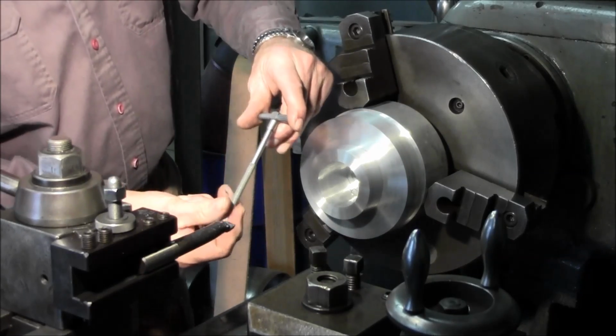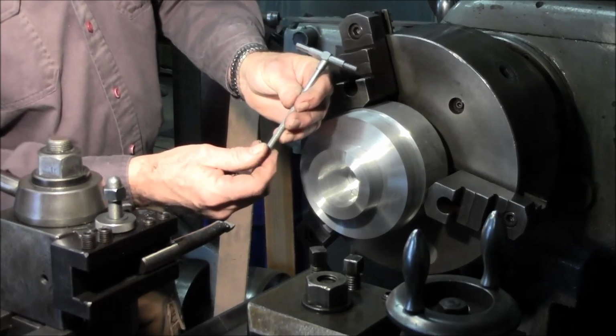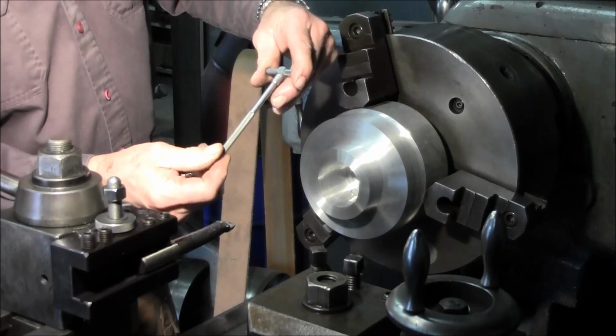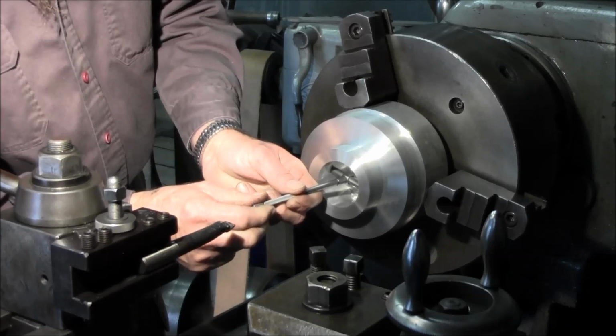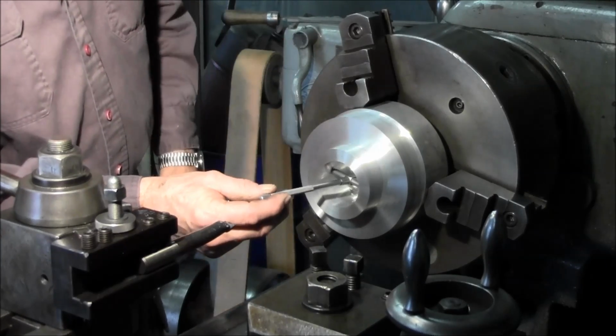Alright, let's go ahead, and this is snap gauges, and they're spring loaded, 2 of them here, and there's a barrel that tensions them down here. Alright, so we're going to bring this slightly under tension, just so that we can stick it in the hole, so it's got room to play there. Alright, then you go ahead and you snap it so it's there. Snap gauge slightly cocked at an angle.